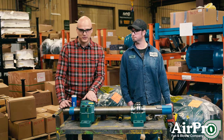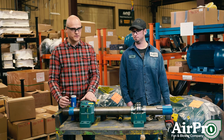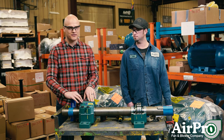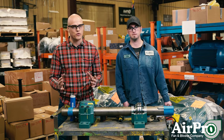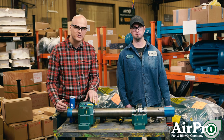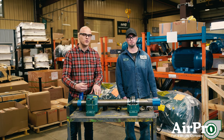You'll want to follow the IOM manual that you get from your bearing manufacturer and grease it on that schedule. Centrifugal fans are high-wear machines — they're spinning fast, often at the top of the rotation range allowed for these bearings. Consult your IOM right away. We've seen situations where customers thought pre-greased bearings would run for a long time, but sometimes you need to grease them twice a week or once a week. Make sure you check that and don't run them too long and get dry, or you can have a major failure.